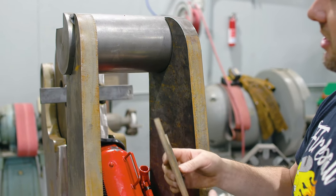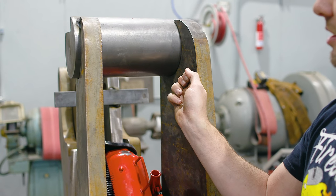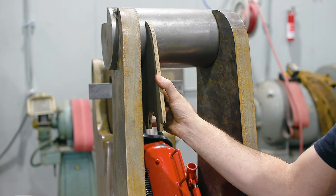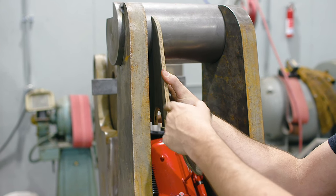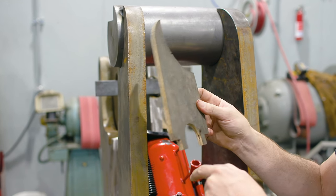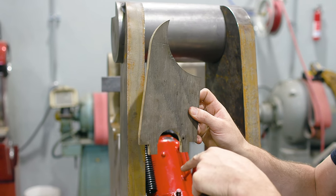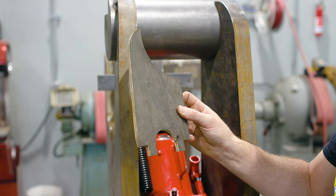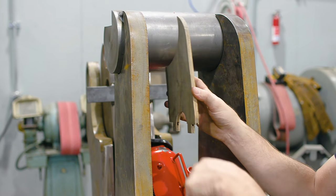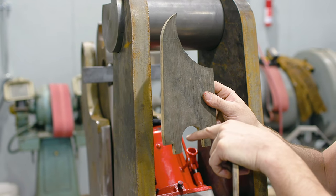This is gonna pose some challenges because these plates have been welded at a 5-degree angle. So I have two choices here. I can put this connecting rod straight and have a funky gap, or I could lay these brackets on its side, which will then lead me to have to cut a 5-degree angled hole through this part. So I think I'm gonna choose the simple and clean approach, mating this aside and putting a 5-degree angle through this hole, which I think the water jet can do pretty easily. So we have some water jet cutting and some machining to make this bracket come to life. So let's go do it.